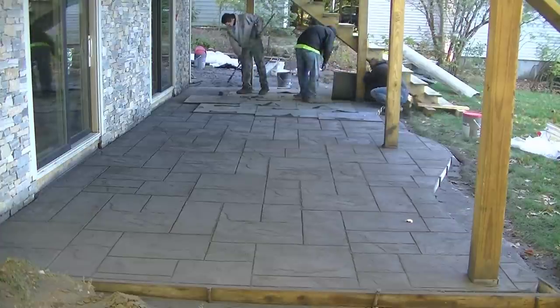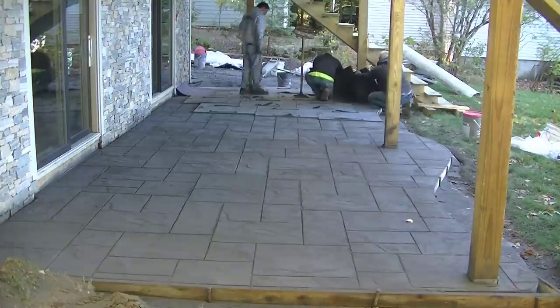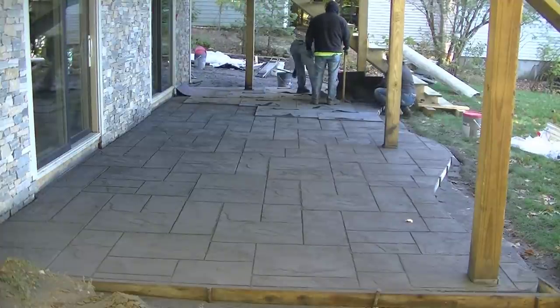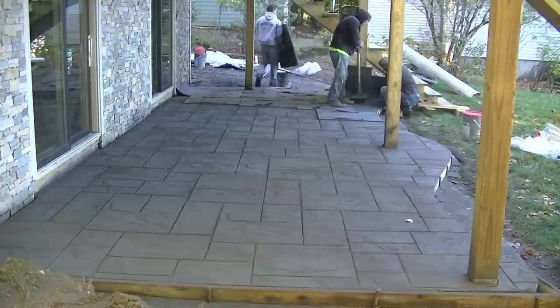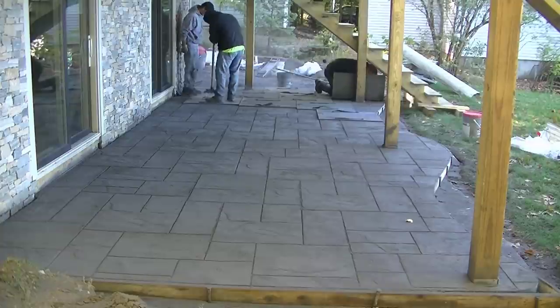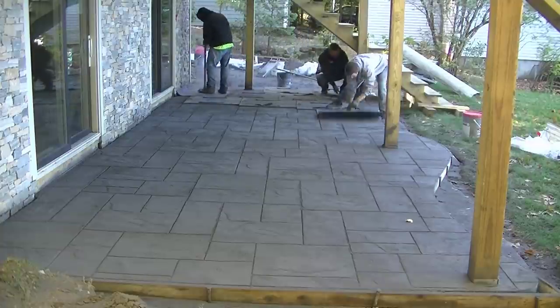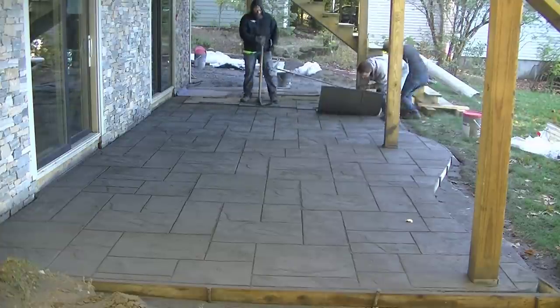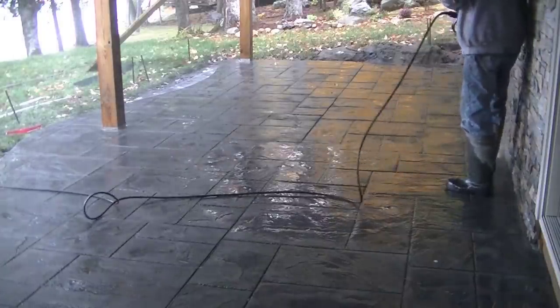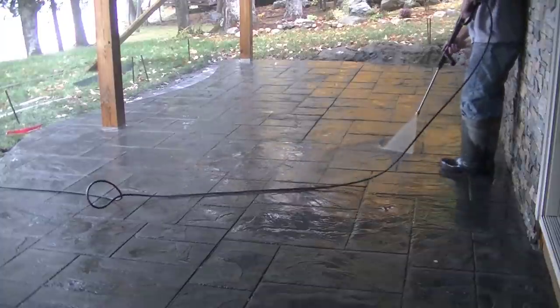You can see how we're moving along. Luke's got all those columns to go around — they're wrapping the stamps around the columns to get good texture and groove lines in there. I'm wrapping a flexible stamp up against the building to do the stones right up against it. Then we're touching everything up with our touch-up tools to make sure all the grooves went in really nice.